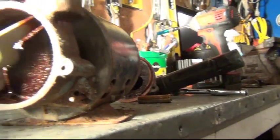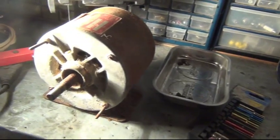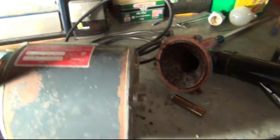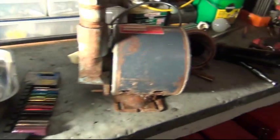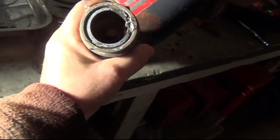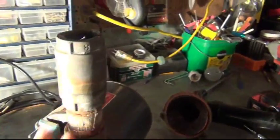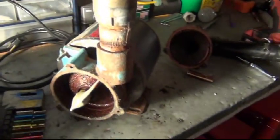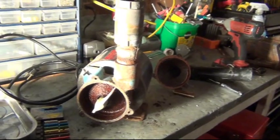I'll pull the pump off the motor and open the motor. There's a spare motor here and we might be able to take some parts off it, but it's pretty old. This one is a newer motor, so I'd like to keep this one, but if I need parts like bearings I might take them from there. There's also a check valve in here that's kind of stiff, so I might remove that and put a newer one on. The check valve closes when the pump pushes water out so the water doesn't go back into your tub. This is for a tub to wash dogs and animals.